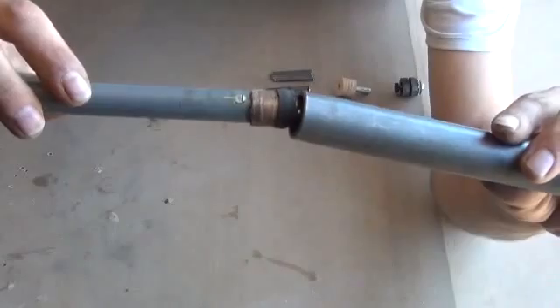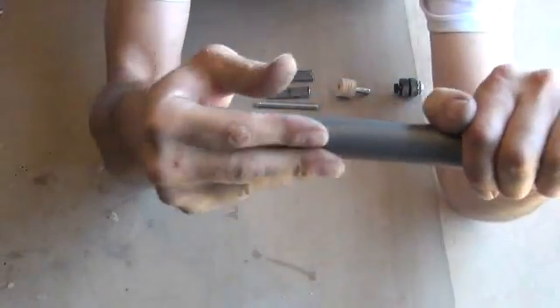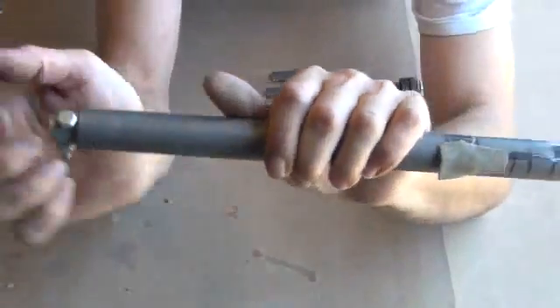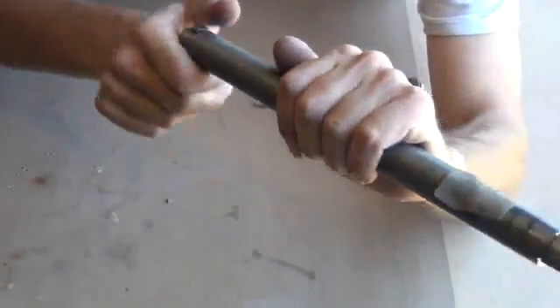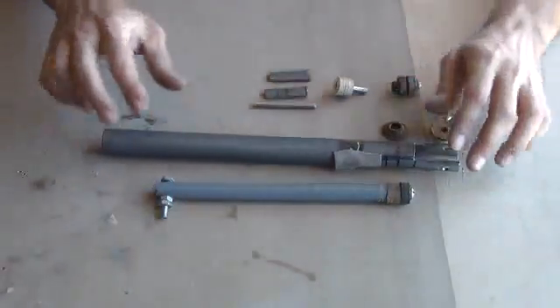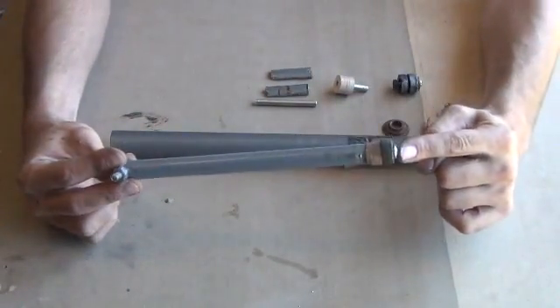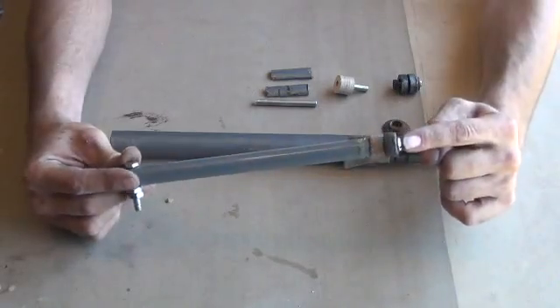You'll notice when this goes inside, it's a very tight fit. You can't see how much I'm straining to push that in there, but it's got a lot of pressure going down, so it makes a great seal inside of that tube. You basically just need a housing, a rod, and a pump head, and you can use leather or rubber or whatever you've got for your seal head.